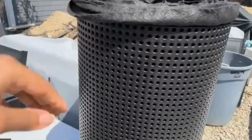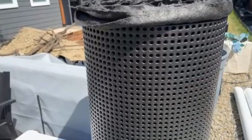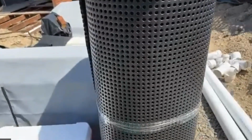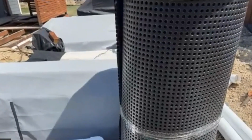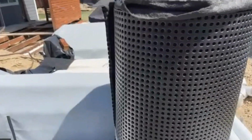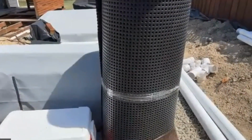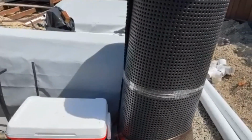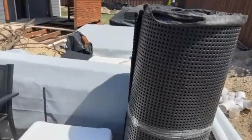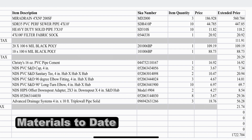Here's the dimple board, and you can see there's a felt cloth, and there's little bumps that stick out from the cloth, little nipples, hundreds of them. What they'll do with this is attach it to the wall, so that as water comes down the wall, it goes down that dimple board, through the felt, and down into the trench below. I don't always recommend this, but this is perfect for those two different types of foundations that they've joined together, and it will really help a lot.